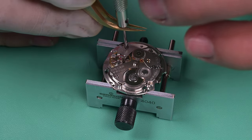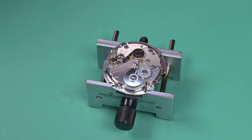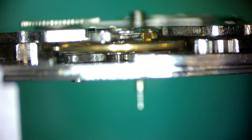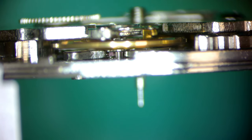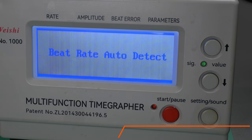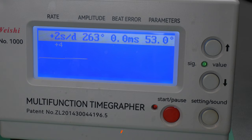We are off and running — that's about as quickly as we've put the timekeeping side of a watch together on this channel. I let this run for about 24 hours after putting a full wind in it. I'm checking the hairspring again, looking at the impulse jewel on the underside — it's rotating around really well. If you have a really low amplitude, something is wrong; if your amplitude is like 150 or 120, you'll see that jewel won't even reach the other side, 180 degrees away from center. These are the results on the time grapher after a full wind and a 24-hour run, in the dial-down position. Beat error we got down to zero — this thing's keeping one to two seconds in this position.